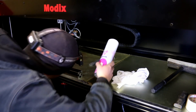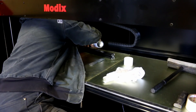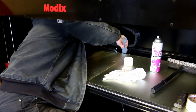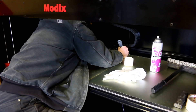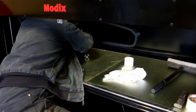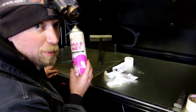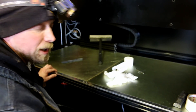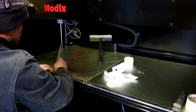Going with the Aquanet here - I'm not getting a good result with anything else. Put that down and then clamp that. I just need a little stickiness - once it starts drying, just need some tackiness there to keep those edges down. It smells like a hair salon! Aquanet is actually extremely useful for 3D printing - if you have a glass bed, just lightly dust it with this stuff and you get really good adhesion. Easy to clean up too - a little bit of Windex on a glass bed with Aquanet comes right up.